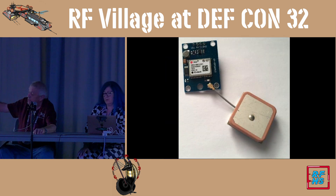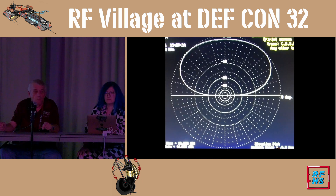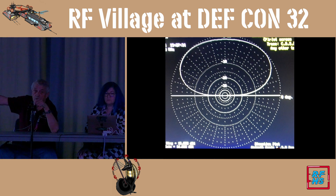We're back to GPS antennas. These little ceramic antennas have a very broad pattern and they receive all the way around to the horizon. Most of the GPS satellites you detect are near the horizon. The problem is that jammers and spoofers are usually going to be on the ground, so what we really want to do is stop receiving signals from the ground. So we put a ground plane — a sheet PC board or sheet aluminum, about four to six inches across — under this antenna. You now get near-zero signal from the horizon. You've lost a couple of satellites, but you've also lost the jammers or the spoofers.